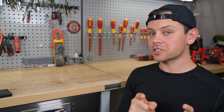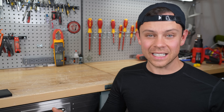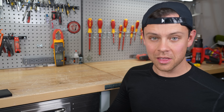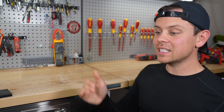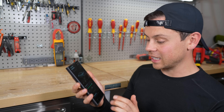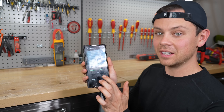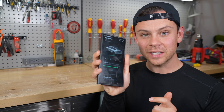This advice is specific to solar systems with lithium iron phosphate. If we were talking about NMC or NCA chemistry, I would have a completely different recommendation — never charge to 100%, charge to 80% always, because those chemistries don't need to reach 100% to balance the cells. My Model X has 50,000 miles and I charge it to 76%, because that is not lithium iron phosphate.